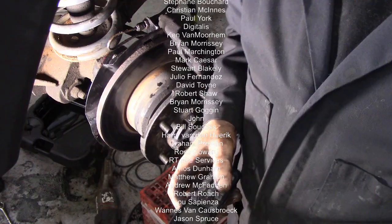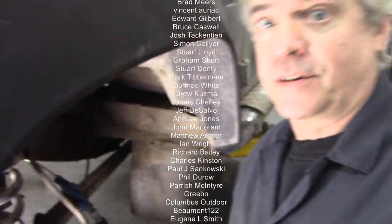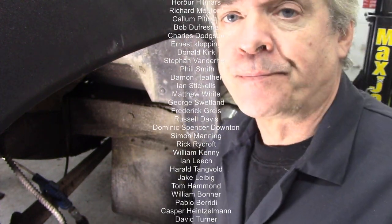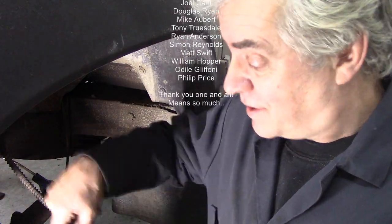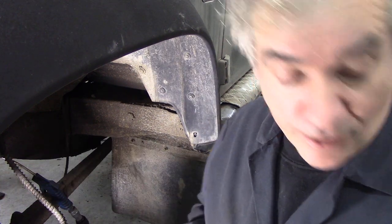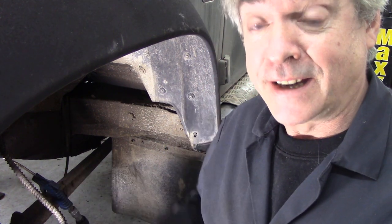My floor's gone flat. I'm going to top up the grease, top up the oil, and that'll put paid to that. I'm glad I caught it in time - I didn't want to run that hub dry. The thing to check when you're checking your oil is whether it's all like grey grease, because the grease has come from this hub and gone into the oil. Is it detrimental for the oil? I don't know, but it's not good for the hub because it can't get back in again.